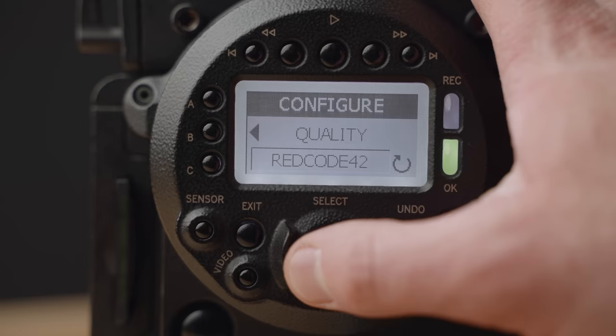It's no secret that the Mysterium sensor loves light and isn't the cleanest at higher ISO levels. After filming tests and reading from other Red One shooters online, the consensus is that ISO 320 and 640 are preferred for a clean image while still having great dynamic range. I found I was comfortable shooting up to around ISO 1000 or 1280. ISO 1600 and higher is going to introduce a lot of noise. The image quality is pretty incredible — I put together a little interview setup, threw on my favorite vintage lens, and was really pleased with how the image turned out.